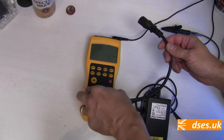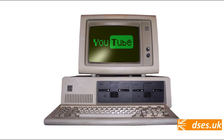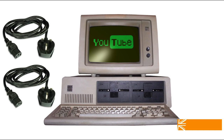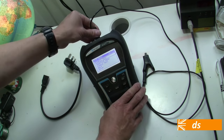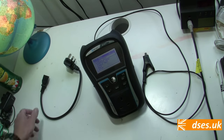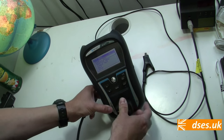My short IEC lead can also be used to connect to IT equipment and power supplies that lack their own power cords to enable testing on those appliances. On a typical desktop PC setup you're probably going to have two IEC leads — one for the monitor, one for the computer — each subject to their own PAT testing requirements, plus the monitor and the computer unit itself. So there could potentially be four individual PAT tests just for one desktop PC setup. Before we move on to my rogues gallery of things that have been passed improperly by others, let's have a quick look at a couple of other testers, starting with the Metrel MI3311 — this is Nige's PAT tester from back in the day when he ran his own business. It's a nice bit of kit, certainly a better physical display than my Martindale, although the way it presents information is arguably not so good, as we shall see. Let's perform a test on this IEC lead here.